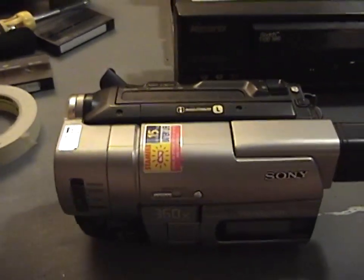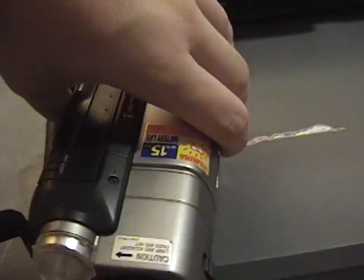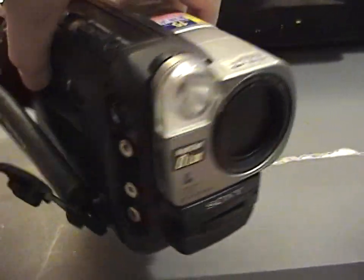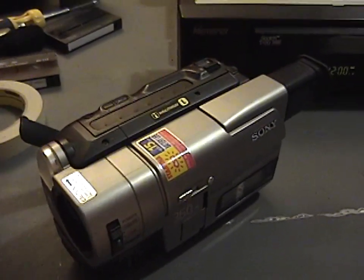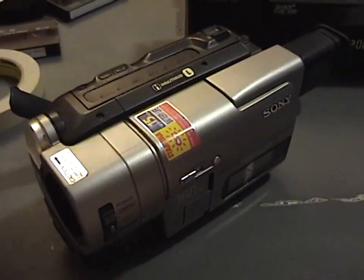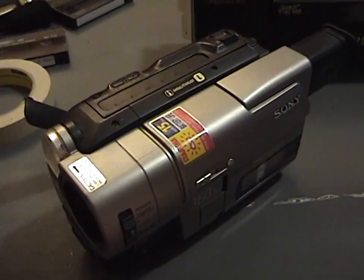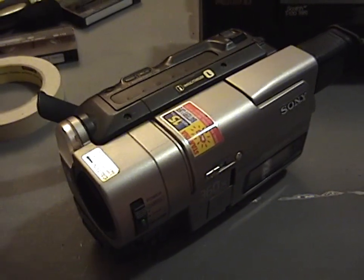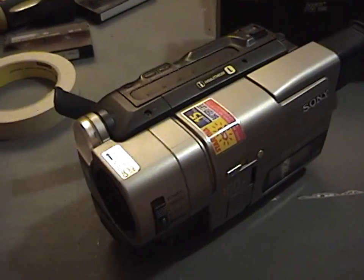This is the answer. I'll digitize that tape using this camcorder instead of the Digital 8. This one's got a set of composite jacks on it, so perfect. I thought I would just show you this problem I encountered and how I managed to solve it. It's not going to produce a perfect reproduction unfortunately, but it is our best bet for getting the best possible digitization of that damaged recording.